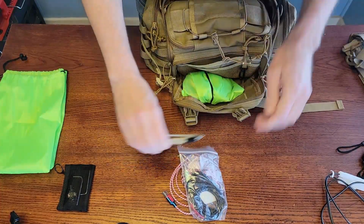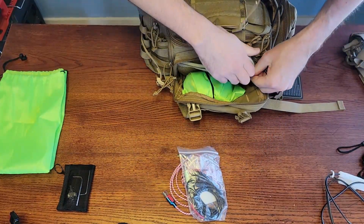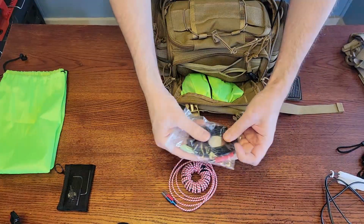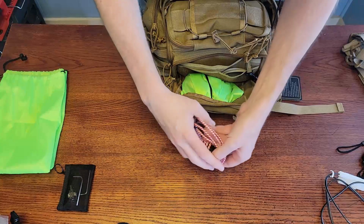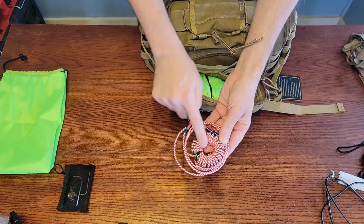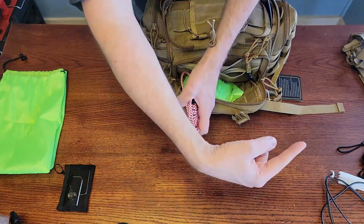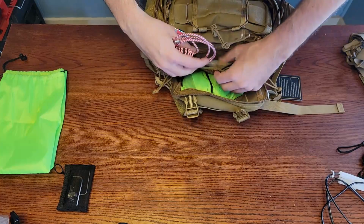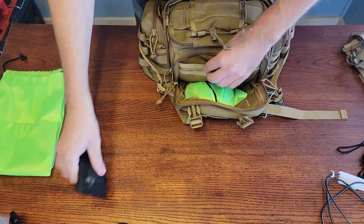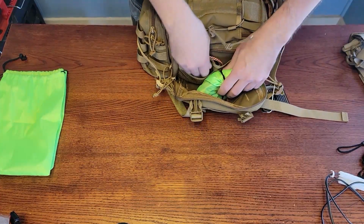because there are little pockets in there. Okay, so we wrap that up and put it into that pouch there. Good. These are the LDG tuner cables, which we're not using anymore. This is my gas station USB cable that solves the USB noise, wrapped around a 240-43 toroid. There is a video right up there about solving the noise problem. We can put that in that pouch there. Put these little guys in that pouch there.